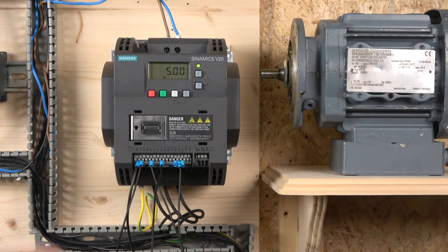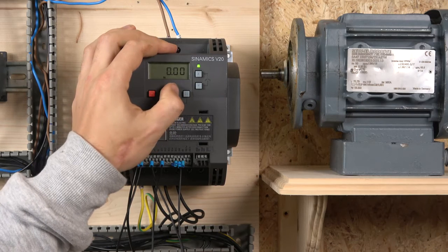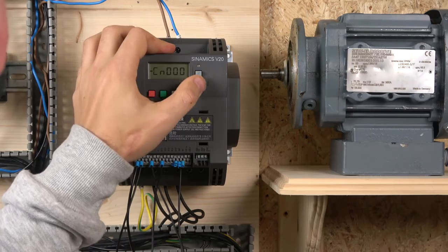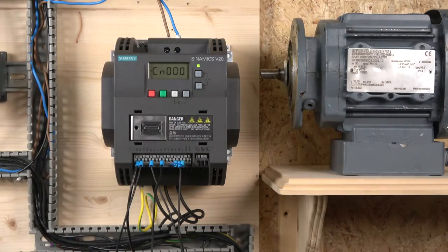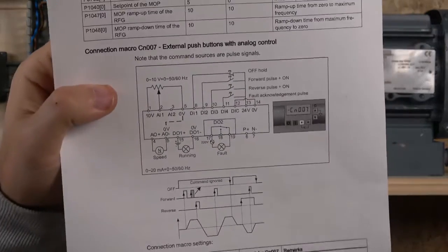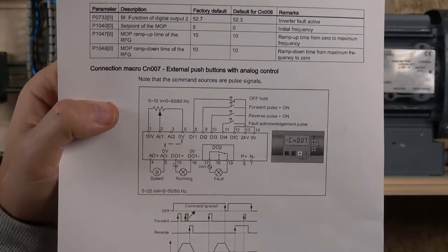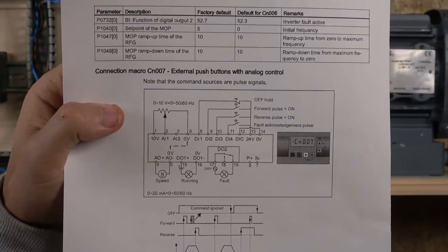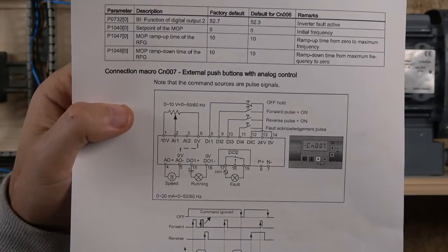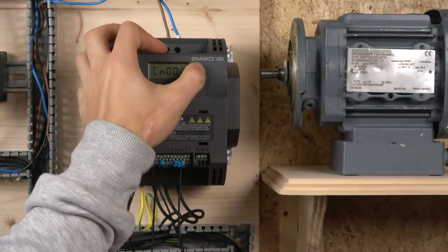Right, I have set up all the motor data back in, so now we're going to select our macro group. Hold it for 2 seconds, press M again, then our macro group. The one we're going to be using is macro connection 7, I call it group or connection, whichever way, is this one. There's another one that can do the same functions, but it's a little bit different, so that will be demonstrated in the next video. So we're going to be using this group to do our 3-wire connection. So let's go for a 7.